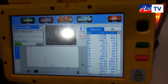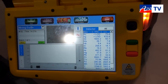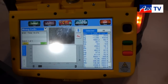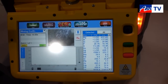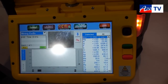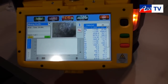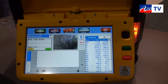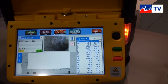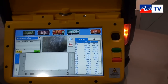As with our handheld analyzers, the longer your measurement time, the better the precision. For every four-fold increase in measurement time, the precision improves by a factor of two. A couple of the features we've taken from the laboratory and brought to the field are a 10-watt X-ray tube — that compares to the 2-watt X-ray tube in our handhelds. What that means, everything else being equal, is that customers will be looking at detection limits roughly 50% lower than our very best handheld analyzers. At the same time, we'll have options for an XY sample stage as well as a sample spinner — both features typically found in lab-grade XRF analyzers.